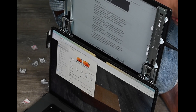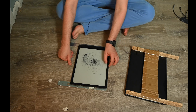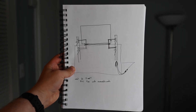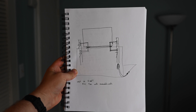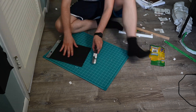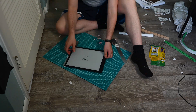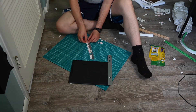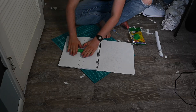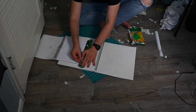I also wanted to attach it to the back of my screen rather than the front, so that it didn't block the view. I thought it wouldn't be an issue the first time because the screen has these little bezels, but I needed too much width to make sure the sliders were securely attached. I couldn't find exactly the right components online, so I decided to build it myself. This time I figured out how to take my original design and dumb it down to something way simpler to make. My idea was to attach two thin flat pieces of metal to the back of my e-ink screen, and then build a track — literally just something with a crevice in it for the laptop to slide up and down. There's a trade-off between making something lightweight and making something sturdy, but I decided to use wood for the track because my efforts to make it out of clay were unsuccessful.